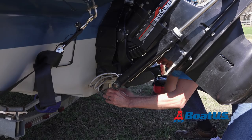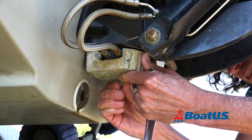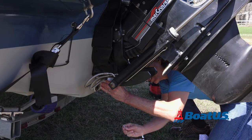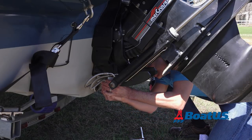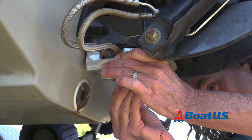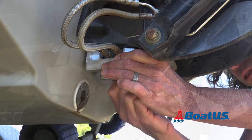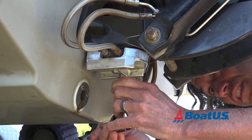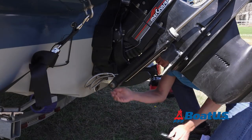So, the right tools. This is an easy job — this anode is only held on by two screws. Now we'll replace this transom anode. Just two screws, one on each side. Always use new hardware. The set will come with brand new stainless steel screws, and you want to use those. I'm going to snug these up — and there you have it. That was the hardest one.